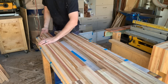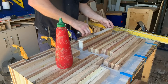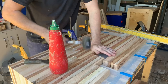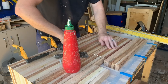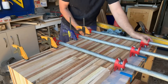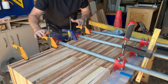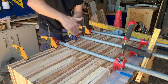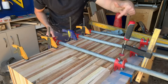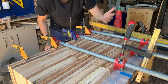It's simply a case of having a good look at the colours, cutting them to size. Most of this stuff's going to get used, so you don't really have to measure too much at all. Then it's a case of glue it all together — there's plenty of gluing surface — tap it all into place and get ready to clamp. These clamps here are just stopping it from lifting and keeping my first straight edge. Then I've got my bar clamps on, pull it all together and another clamp on this side to stop that end picking up. That's pretty much it — tons of gluing surface in there.